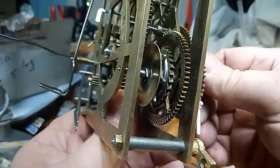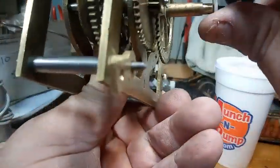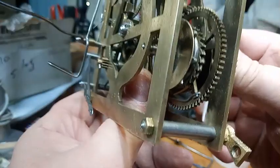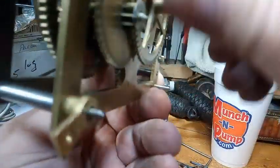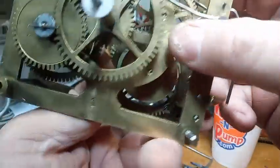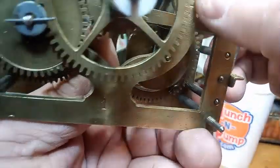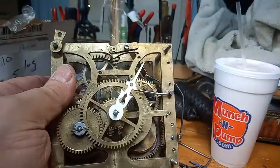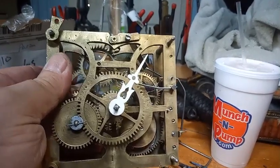And now I got, remember I also told you that whatever you do to this wire affects the back wire. So now when I rotate the hands, nothing's happening. And that's because I got the back wire out of adjustment. So I have to fix that now. They're lots of fun, cuckoo clocks. They will make you go cuckoo.